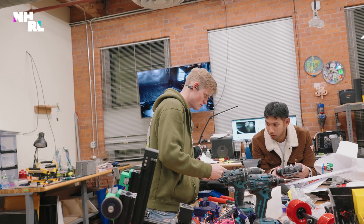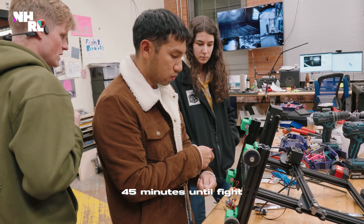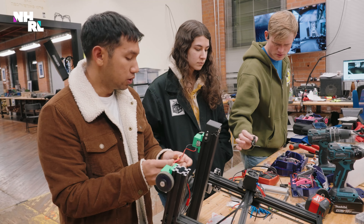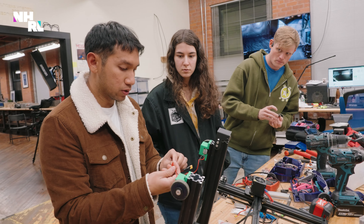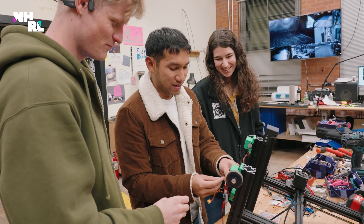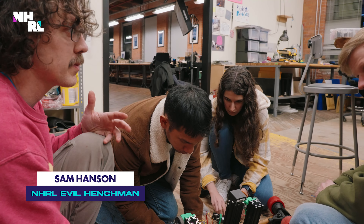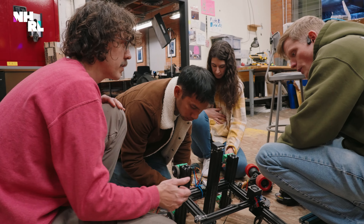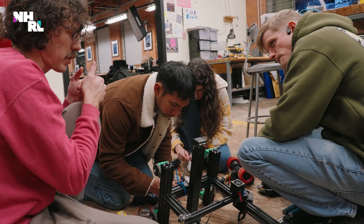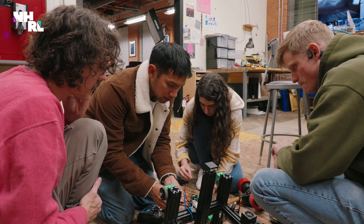Are you using the camera system sometimes? No, you can use that — that's the servo tester. This will have to be figured out, it's literally just trial and error. If one's going the other way, just swap them. You need a Y harness — two Y harnesses for the servos — just to split the signal between these two so they can share. Both of these ESCs have a BEC, so you don't need a battery for your receiver. They put out five volts, but BECs don't work well together. These must be ones that just hate each other.